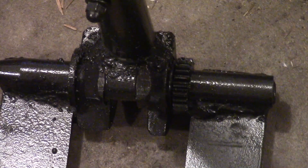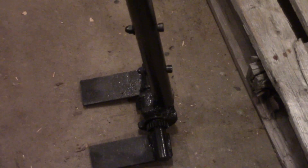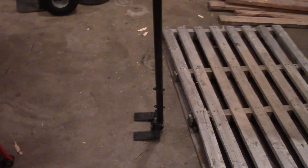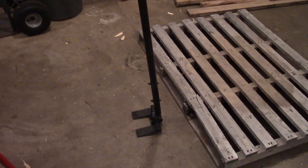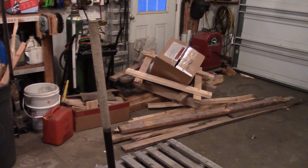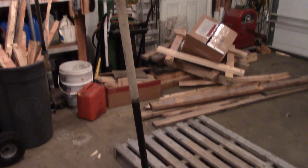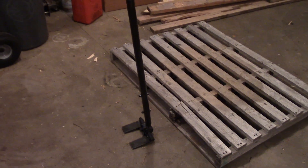So I kind of made a pallet ripper tool out of what I had. Basically it's a crankshaft from a small engine, and there's a piece of a tractor transmission that goes between the counterweights. It comes up here, it's narrower than the pipe I have, and then it has some bolts holding that on — all solid steel — and then I have a galvanized pipe that I painted. This thing is angled forward a little bit, maybe like seven or eight degrees. It's really heavy and really fatiguing. I tried to make it so I'd have some extra leverage, and I kicked down on the thing once and — just like in the cartoon when the rake hits you in the head — I got hit in the head with a metal pole and it didn't feel too good.